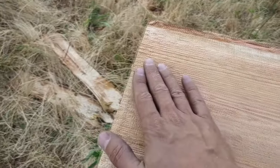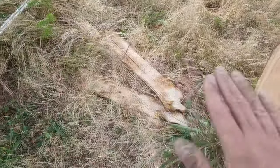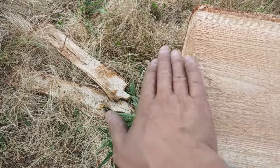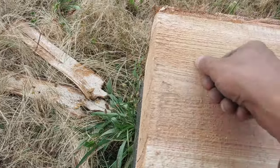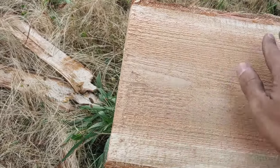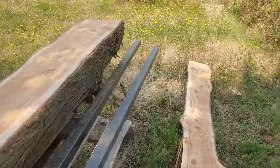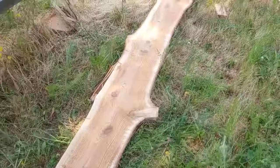And you noticed as I came out, I pushed the bar all the way out past the wood. Because if you push it this far and stop, it sometimes tips and it'll gouge the wood on the top or the bottom, but I have a nice finish all the way to the edge, both on the start and finish. And then here's the top slab.